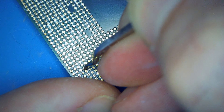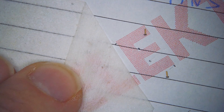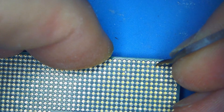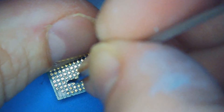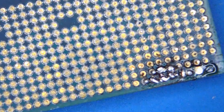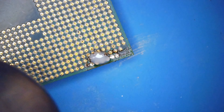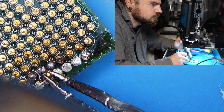There were a few that really killed me later on because they were completely flat. I was able to get them up, but they actually fell off after I finished the video so I don't have a picture. One of the pins actually completely came off, which made some future issues we'll go over as the video progresses. Here was another mistake I made: I used regular solder instead of lead solder to kind of clean this up, so I had to get some wick. I tried the flux pen to actually bend the pins back — that didn't work. And then here comes mounting the pins, which is probably one of the hardest parts.